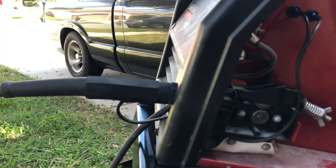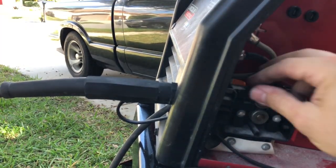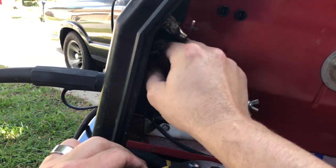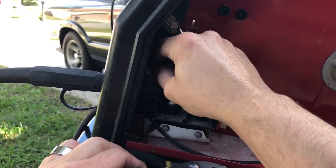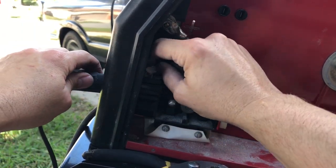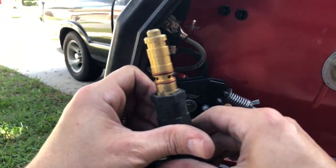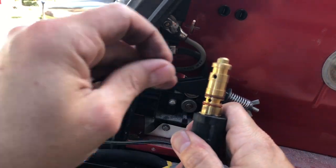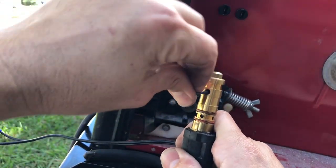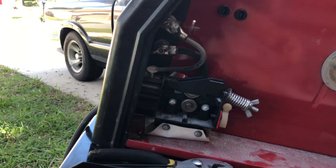So you take a flat head screwdriver, pull that up, just disconnect your wiring here. There's a little set screw in here — this is the set screw I'm working with right here. Loosen that up; that's holding in your assembly here. Pull your wiring through the front, get that out of the way, and once the set screw is loose, just give this a good little pull and that'll come out. Now what's actually holding the liner in — there's a little allen key set screw right here for that liner. So you loosen this up and then you should be able to just pull your liner out. Let's test that theory.